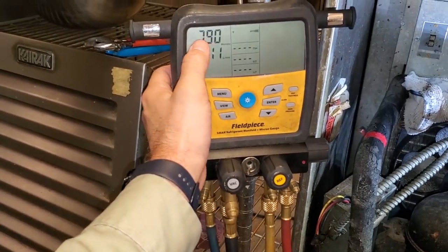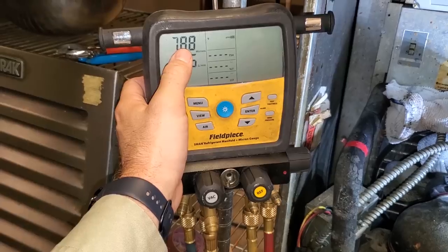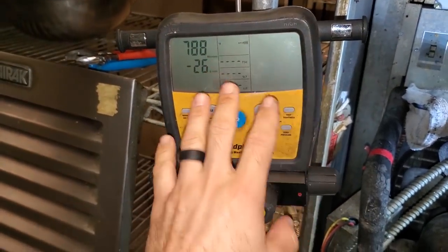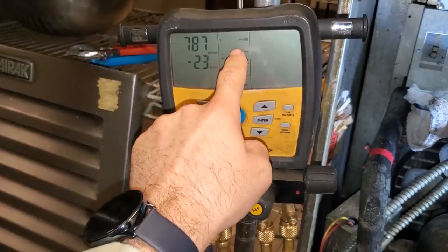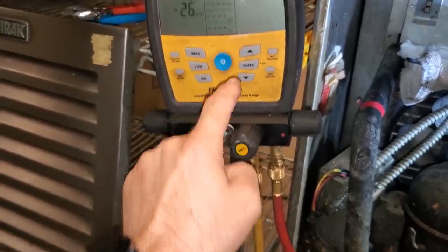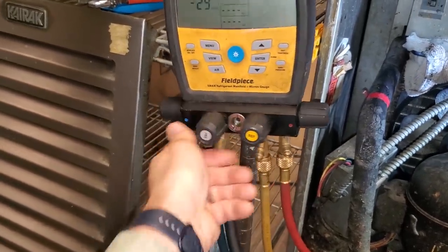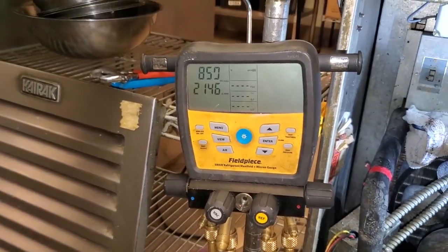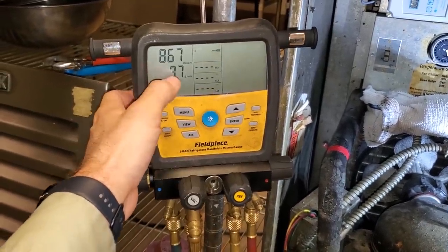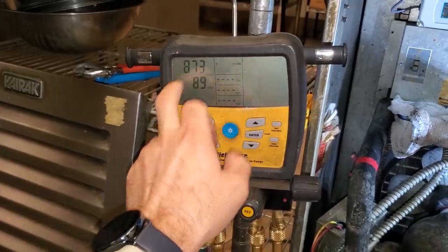My manifold has a built-in micron gauge and it says 789 microns — it is not below 789 microns in the system. The micron gauge in the manifold gives you some false readings. If you don't know how to read it, that means it's 789 microns between this pump and this manifold micron sensor. This micron sensor is before the system — don't trust that. I can prove it by simply closing off the evacuation and you can see it rise because now the system is getting a pull on the micron gauge. That just shows you that just because it says below 500 on a manifold does not mean it's below 500.